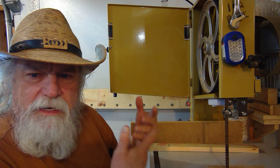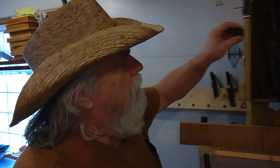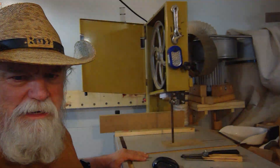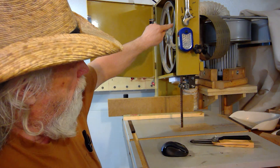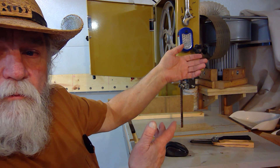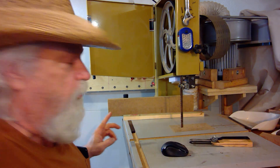This blade is already set to the blade drift, so I'll have to reset that later after the demonstration. Basically we're going to do some cutting. The first thing I want to do is start it up, bring the wheel forward as far as I can. I need to move the camera back just a little bit — okay, that's just enough to get in here. Let me start it up, adjust this wheel until the blade is riding all the way out, do the test and check that angle, then move to the back of the wheel, do another test, and compare the two on the bevel gauges.